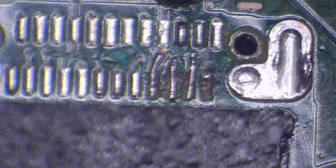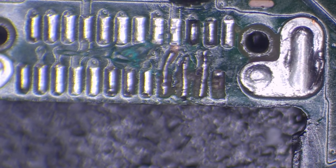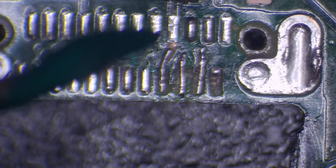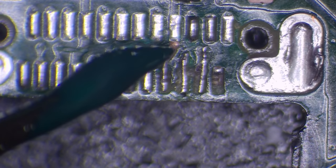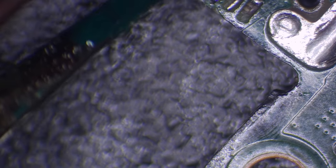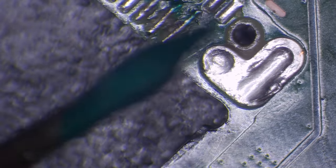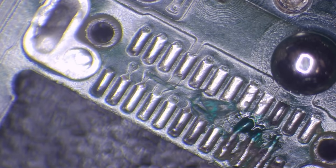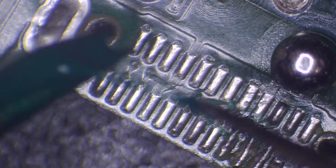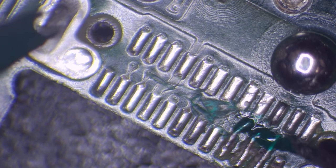Let's dry that off and trim this middle jumper wire a little bit, because we don't really want it hanging over the edge of the groove where the original trace was — otherwise the port isn't going to sit flat. We'll trim that down very slightly, there we go. And then I'm going to add some conformal coating. For the conformal coating you really don't need much — all I'll do is get some on the end of my tweezers and just basically paint it on until we've got a nice layer just over the edge of the jumper wire. I have noticed there's some conformal coating on this already — I assume that's just from some exposed trace.